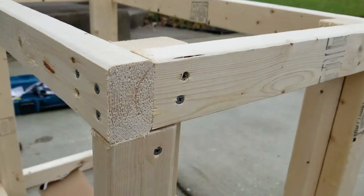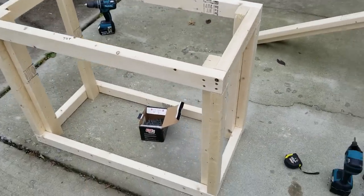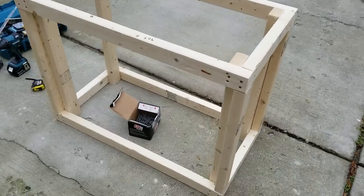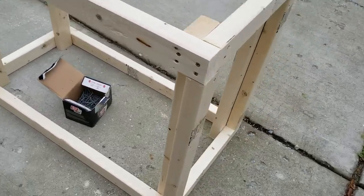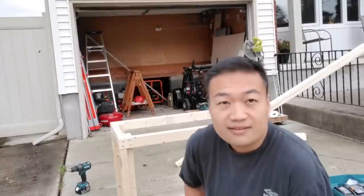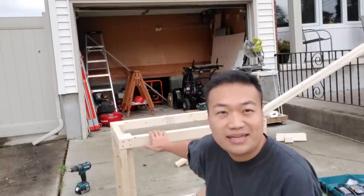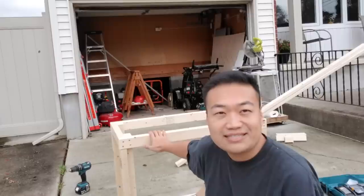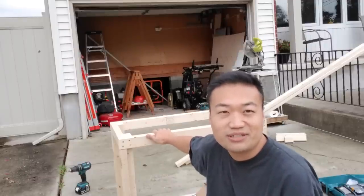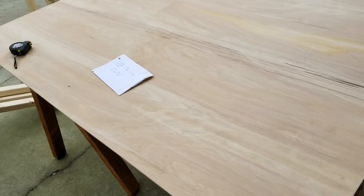As you can see, there are seven screws at each corner. So here is the frame fully assembled — all the screws are in, all the supports are mounted. This thing is an absolute beast. The other reason I have these corner pieces is so that when I put the front and side panels on, I'll have something to nail onto. You're probably wondering how much weight this can hold — I use the same design to build fish tank stands. Something with a 36 by 18 footprint and a height of 24 holds roughly 65 gallons of water, which equates to over 770 pounds. So I'm pretty sure this can hold a vivarium or terrarium.